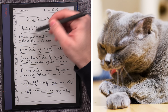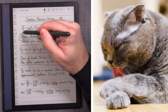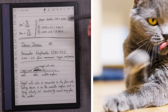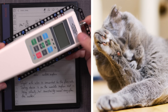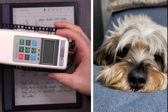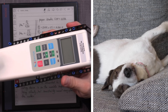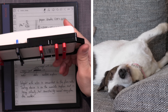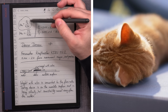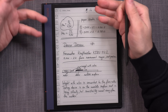That takes care of the normal force part of the equation. What we're looking for is the kinetic friction coefficient. I needed some way of measuring the force of kinetic friction in Newtons. For that, there is a dedicated lab device I purchased — a Sauter, model FH2. This one is able to measure pulling and pushing force to one-thousandth of a Newton — a very, very precise meter, and exactly what I needed.